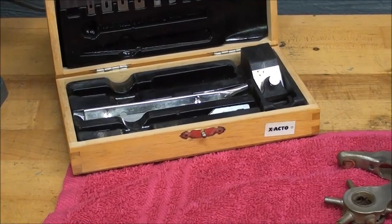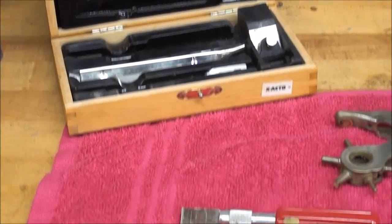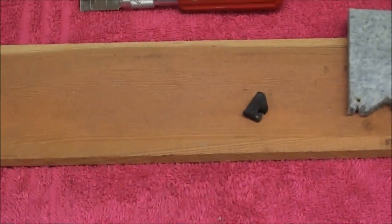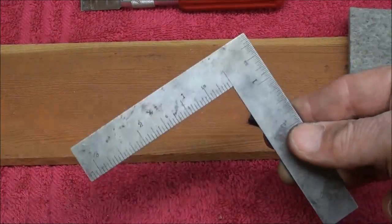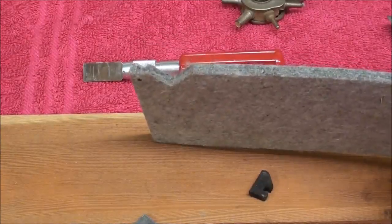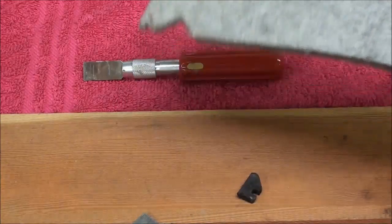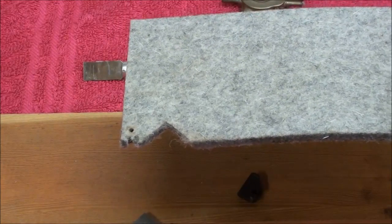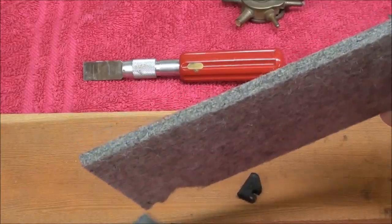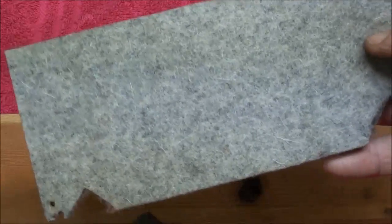I finally made it over to the bench. Here are some of the things you need to make these wipers: perhaps your X-Acto knife set, a leather punch, a regular Stanley utility knife with a brand new blade, some soft wood to do your cutting on, a square, and of course the quarter-inch felt. A subscriber sent this to me - I believe he said he got it from Grainger, but I looked it up. Grainger has it and so does McMaster-Carr, and probably other suppliers. It's quarter-inch thick, gray, firm felt, which is really wool. That's going to be the perfect material. I doubt you'd find this at the hardware store.